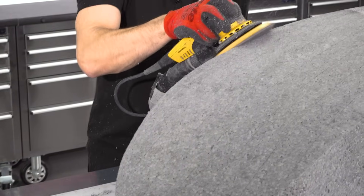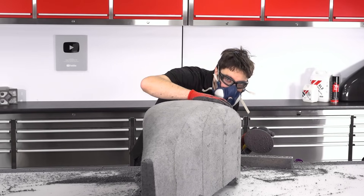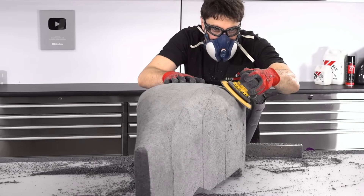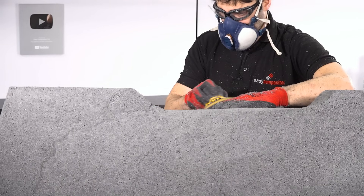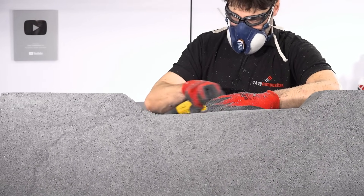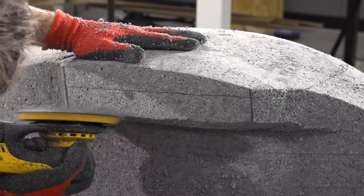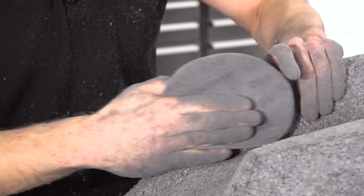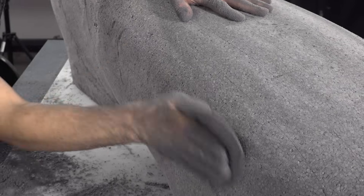When sanding forms like this, you do need to take your time and slowly work it into the final shape. You should regularly check the form both by eye and feel — I find that by running my hand over the surface, I can often pick up unevenness that can't easily be seen. Getting this shape as accurate and consistent as possible is very important, as this creates the foundation for the rest of the process and any faults on the surface here will carry through and cause you more problems down the line. After finishing with the power sander, some hand sanding will help to get into all the small details and finish the surface more finely.